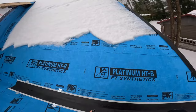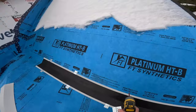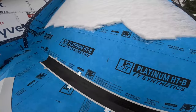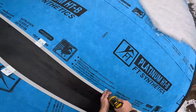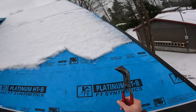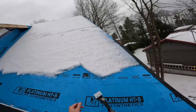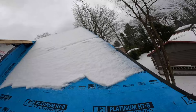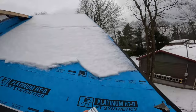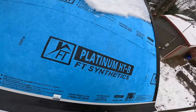Okay. So, all you do is you just take a standing seam clip. I do them really fast now, because I do them all the time. So, I'll slow it down for you on the next one. Because you do need a special pair of, no, you don't. That's bullshit. It is easier with these Stubai folders that I got. These ones here. So watch. You take your clip in, you put it in like this, you squeeze, and you do that, and then give it a little squeeze down so you open squeeze, but look at that, it's beautiful. And then you see how this is angled up a bit? That won't interfere when I hook my panels.